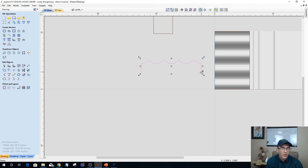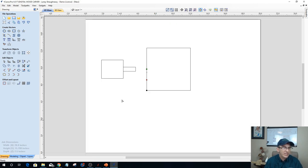Well, that XY0 is that bottom part of that seam. That's why we zero out on the flat, not on one of the corners. If we were zeroing out on one of the corners, if we had this piece rotated 45 degrees and we had our bit centered on one of the corners, we're not at Y0 in our case, or X0 if your CNC wraps along the Y axis. We're more like a few inches in from the bottom. So I don't know if that makes sense to you. I just want you to understand how the vectors get unwrapped.